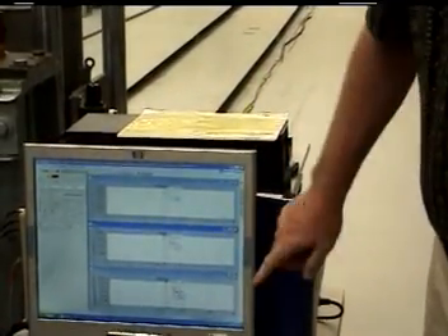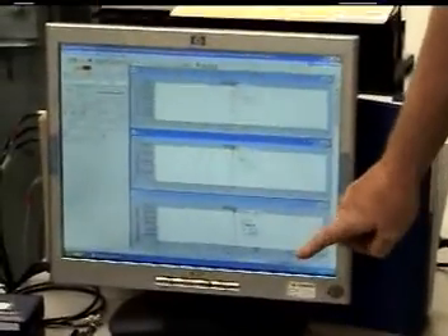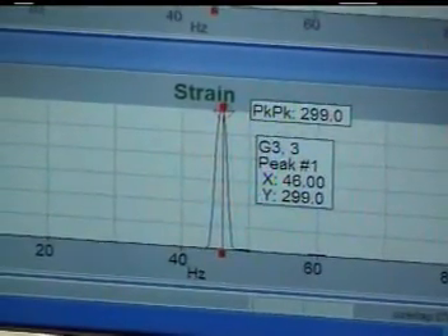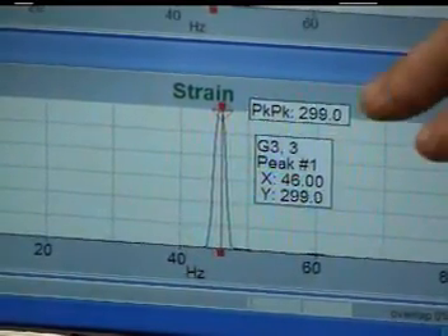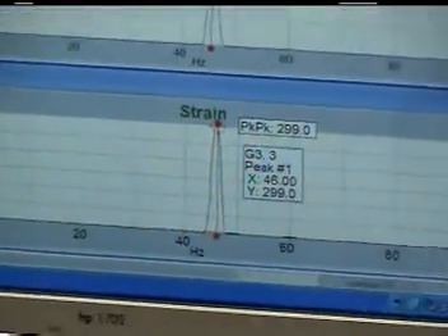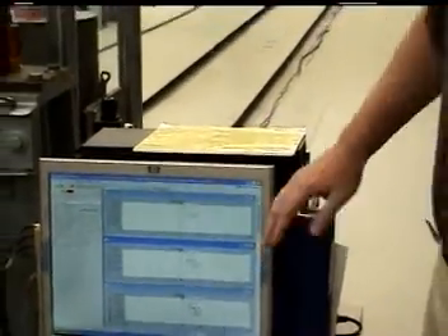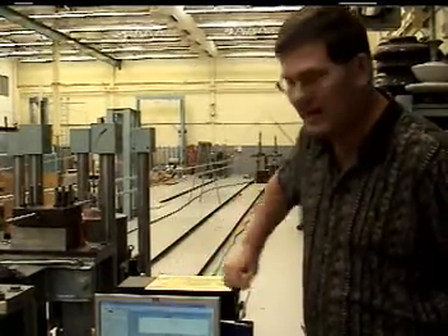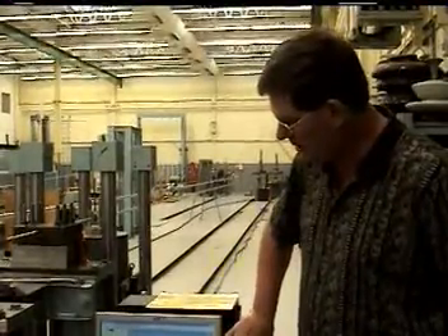In the IEC requirements, you set the amplitude — or in this case the wave velocity — based on the peak strain. The IEC requirement is that we run 300 microstrain peak to peak. As you can see, this last graph shows our strain curve at 299, which is basically 300 microstrain, so this test is running in accordance with the IEC standard. The Australian standard specifies we modify the amplitude to be equivalent to 67 over F, which would give an anti-node loop velocity of about 210 millimeters per second. The Australian standard differs from the IEC in the requirements for what amplitude to set.